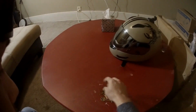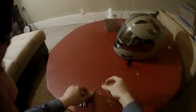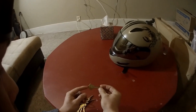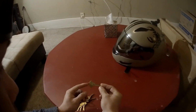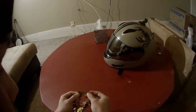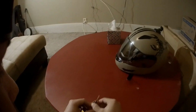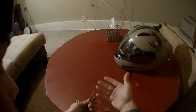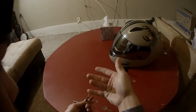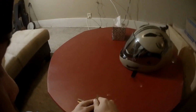So I'm gonna first, to understand a bump key, it took a couple off the key ring here, just understand the general mechanics of a lock. A tumbler lock specifically. A tumbler lock has anywhere between 3 and 5 pins generally. And in essence, those pins hang down. When a key is inserted into the lock, those pins are raised up at various heights. Once they're all at their set heights, it allows you to turn the key.